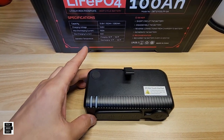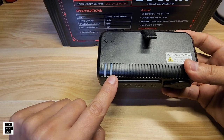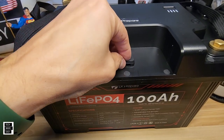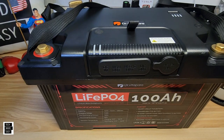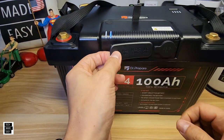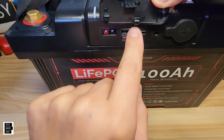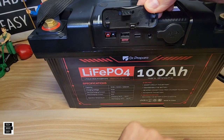Quick close-up of the hub — that's your power button. This is a charge and discharge indicator. On the bottom you've got your Anderson connector — you lay it in place and push it down; to remove, wiggle it up. On the left side you've got your solar Anderson input, USBs — 18-watt USB Type-A, 30-watt USB Type-C — and your car charger and barrel port, both 12 volt, 10 amp.